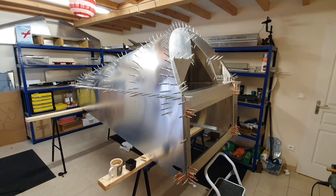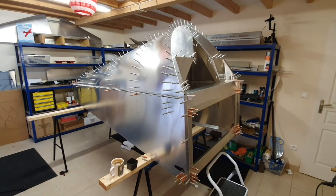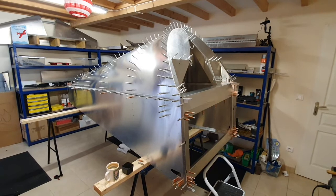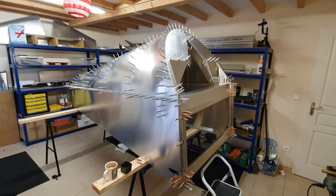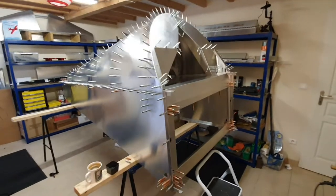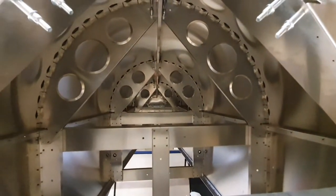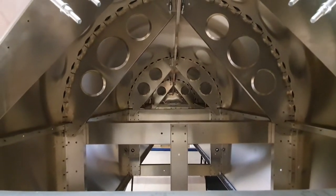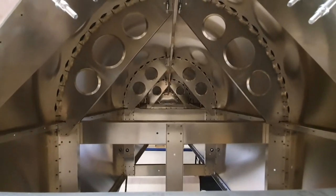About another nine hours work in total since I spoke to you last and the turtle deck is complete up to the silver clico stage. The only thing I've got to do now is up-drill everything and then start riveting. What we've done is fitted formers three and four, which you can see in the back there - took about half an hour per former, so two hours in total to do the four formers.